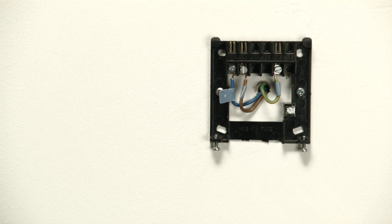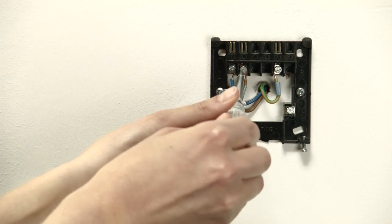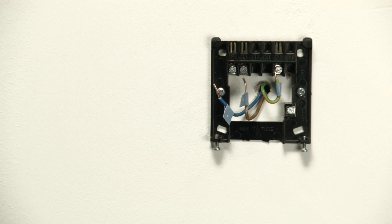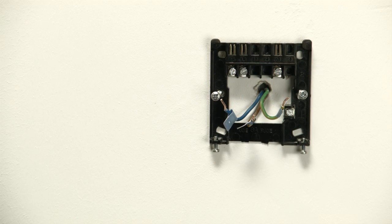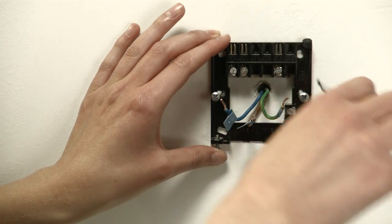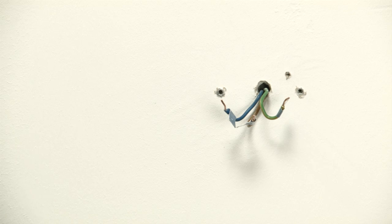Please follow the instructions of the online assistant as the wires are always connected differently depending on the thermostat model. Once you're done labelling the wires you can remove them. Most thermostats have screws that hold the wires in place. Any wires not connected to your old thermostat can be ignored at this point.